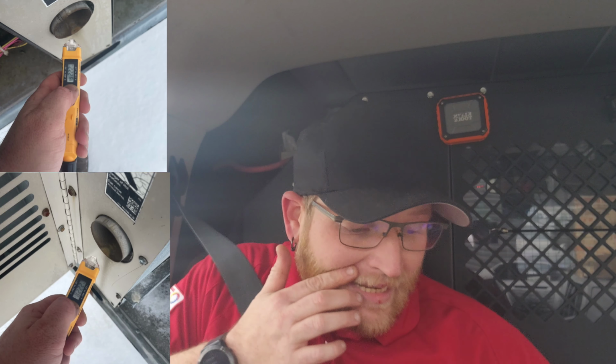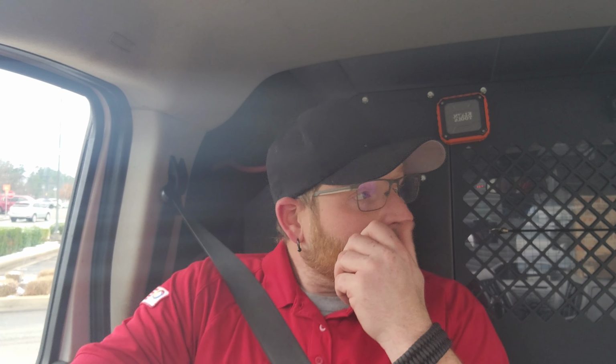So yeah, stuff like that does happen, unfortunately. Fortunately for this customer, we do the preventive maintenance here. Why that would have been missed, I'm not sure. Like I said, it's quite possible that the technician who came in and did the preventive maintenance turned it off for whatever reason, to check gas pressures, inlet pressures and outlet pressures, and just forgot to turn it back on. It's not a habit that we need to make as a company, or as a technician.